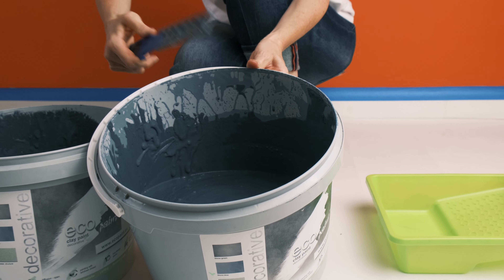We can use either a roller or brushes of various widths for applying the paint. This kind of paint is not well suited for application with a sprayer. To achieve an effect most similar to polish stone or tadelakt, it is best to use a medium-sized roller, then a brush. The final result shows a greater intensity of color variation. We paint using short strokes of the roller or brush of about 30 centimeters in various directions.